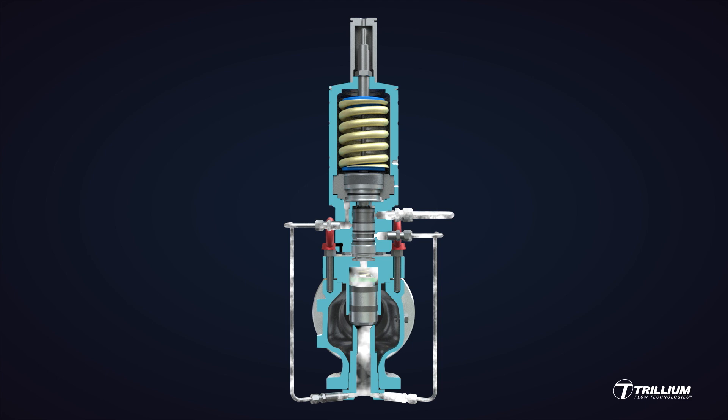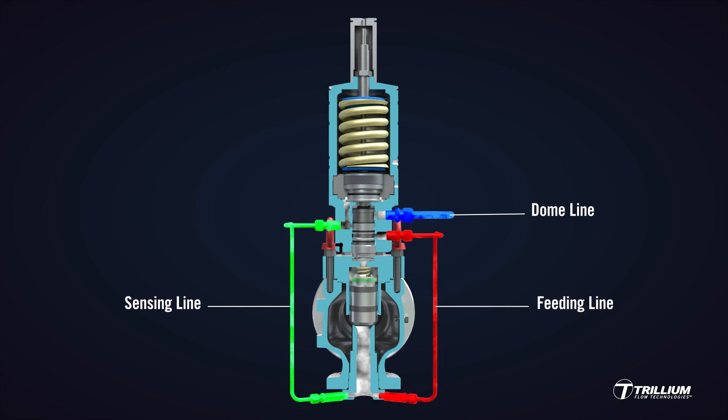The DMS Pilot has a separate pressure sensing line which may be connected to the inlet nozzle flange, as shown during this demonstration. It may also be connected directly to the pressure vessel so that the effects of excessive pressure loss may be minimized and seat chattering is avoided. Static pressure into the sensing line increases the stability of the pilot. No matter the value of pressure loss at the inlet, the main valve piston maintains its balanced position between the dome and feeding pressure once the sensing line pressure is activated.